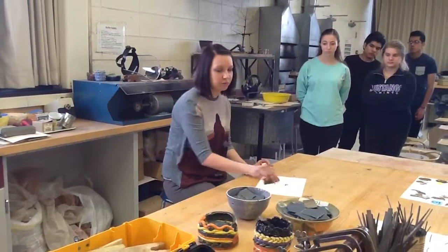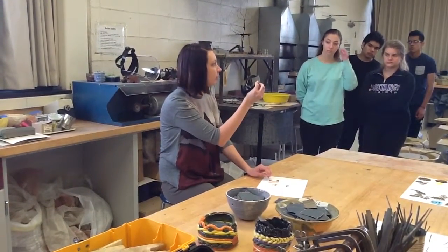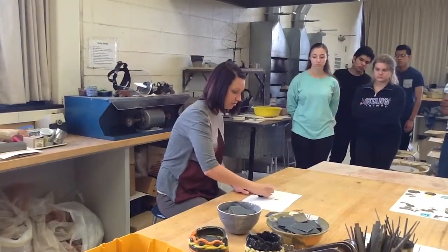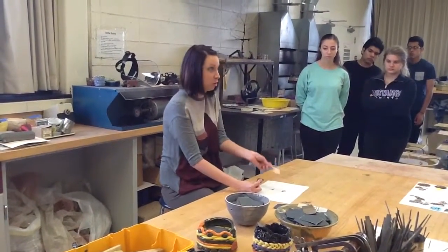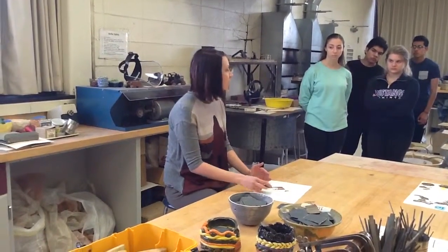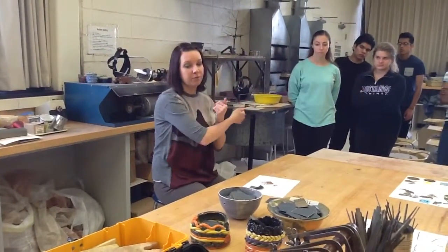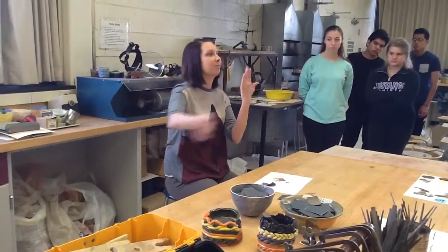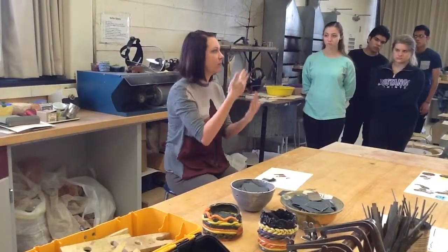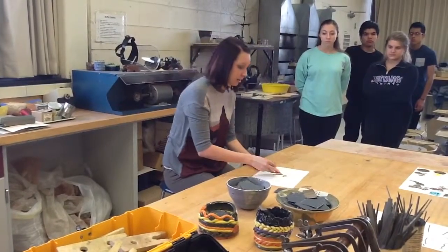From there, you'll move on to the 220. With the second piece of sandpaper, you're going to go in the opposite direction. You can either go left to right, or you can just turn your metal and go in that up-down motion, whatever feels more comfortable for you. But the goal is that you're going in one direction, then the other direction. And then with the 320, you're going to go back in the other direction, and 400 back to the horizontal. So you're creating this layer, almost like a basket when you weave. And all of that is going to erase out all those markings.